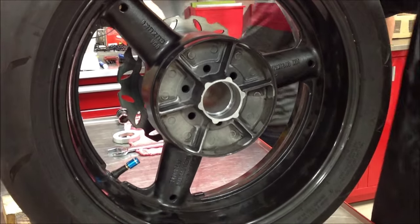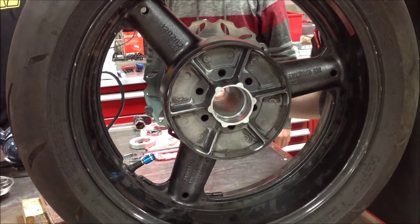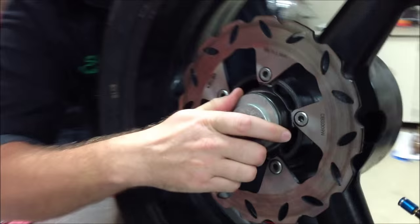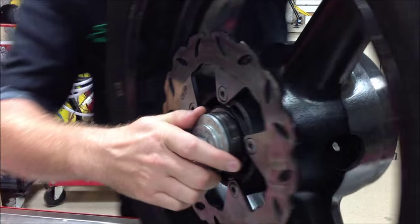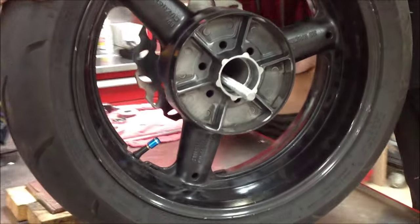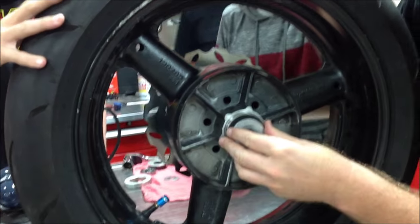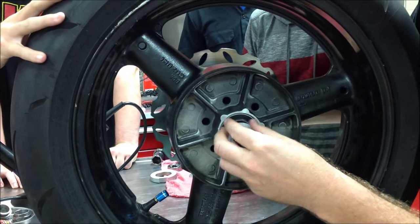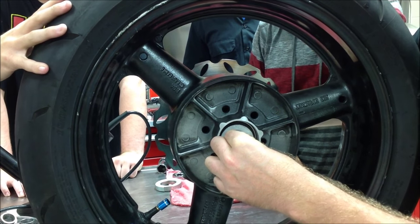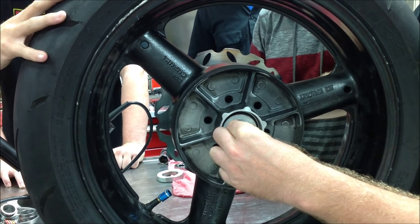We're dealing with heat here, so we're going to block this side so that we can press the tool in. We're just going to set this first bearing. Because we heated it up, we're probably going to be able to just — I didn't even need to press it. We got it hot enough, you see that? I don't want to let go — I want it to cool for a second so it doesn't pop out.